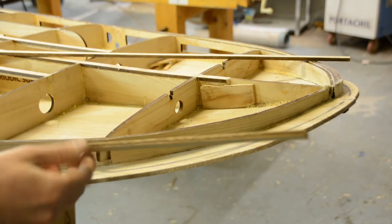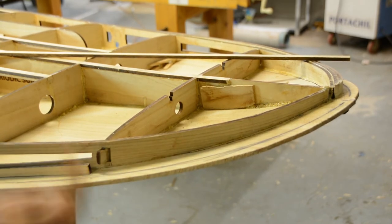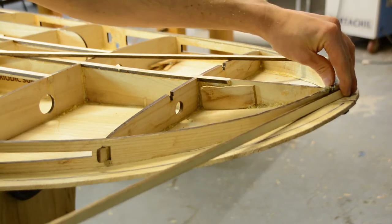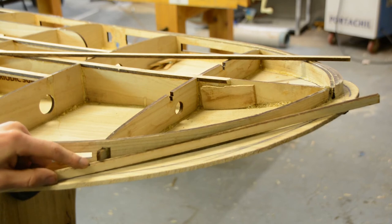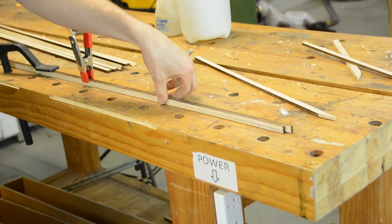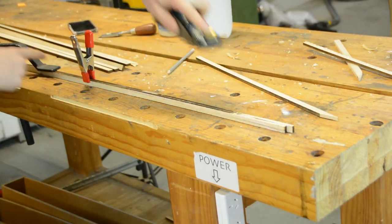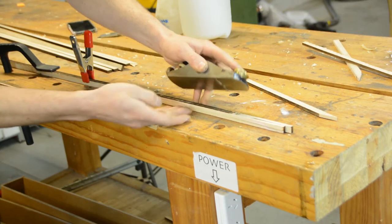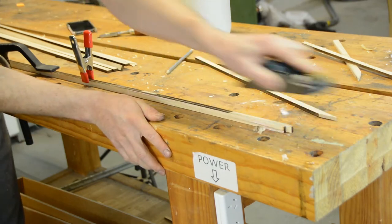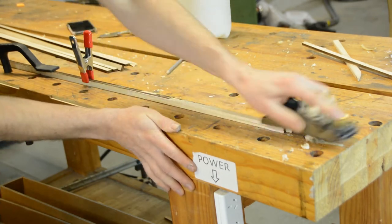You'll notice that on our tabs everything will fit just fine until we come to the nose and tail sections because of that taper. To figure out the length of that taper, I just put the workpiece here, wrap it around, and guesstimate where the taper has to end — around here. To bring in that taper we clamp the two pieces together and use a block plane, taking lots of passes at the tail, doing more passes at the tips and slowly progressing further back with every pass. That induces a nice taper and gets us to where we need to be.